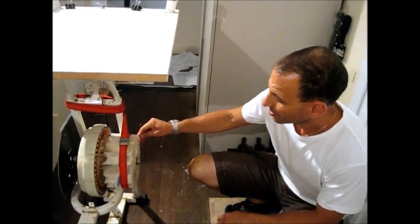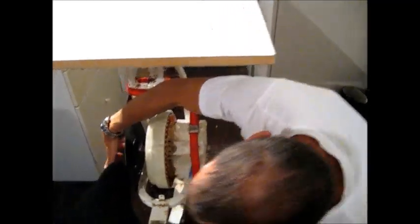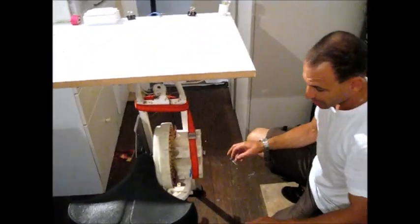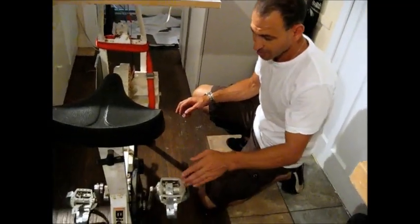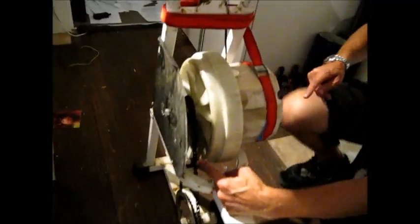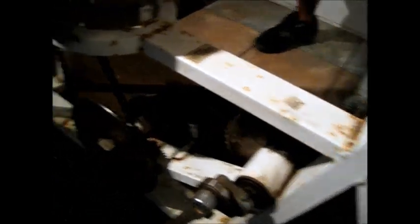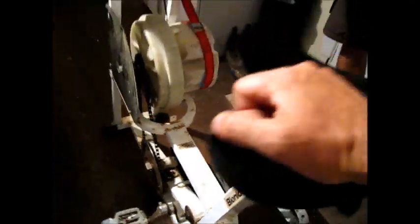What I've done here is simply cut the drum off. Very rough, basic mounting — I'm going to add some sheet metal and some bearings just to make it easier. And basically a very basic throwaway exercise bike from the tip. It goes from a large sprocket to a small sprocket, and then a large sprocket again to a small sprocket, so large on your pedals, then small, large, small.